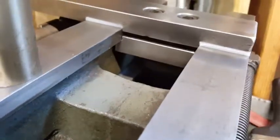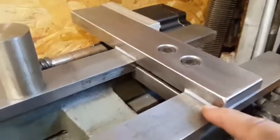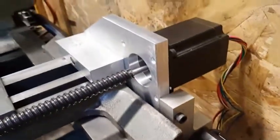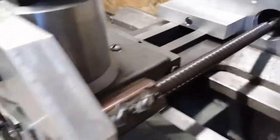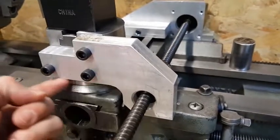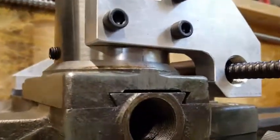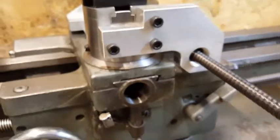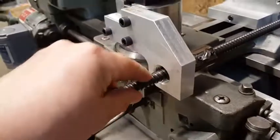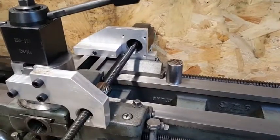The bracket sandwiches on the rails — notice the plastic shims in here. There was a miscalculation by an eighth inch, not sure how that happened, but it's an easy fix. I also had a slight miscalculation with this piece where I had to take 25 thou off the bottom. You can see that rests against the round riser piece. So it's almost there — I'll build these couplers, get this ball screw cut to length, and then put dust covers in place.